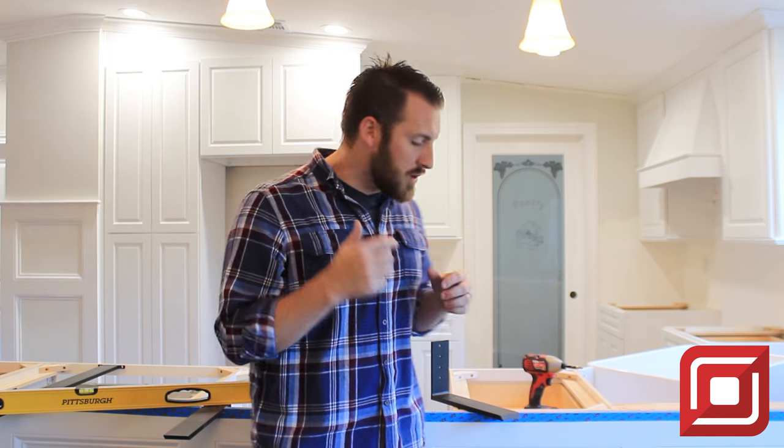Now, to do so, you need to go and get you a 2x6 and mount it on the back, do it a half inch low. We'll tell you more about that in just a minute. The reason being is because you really want something that this L bracket can really grip its teeth to, if you will. And once you do that and you've got that in place, I'm telling you, you are not gonna be disappointed. So go ahead and grab yourself a Dremel tool or something of that nature, get yourself a drill, and this is gonna be a simple project that's gonna take your house, your office, or the job site to the next level.